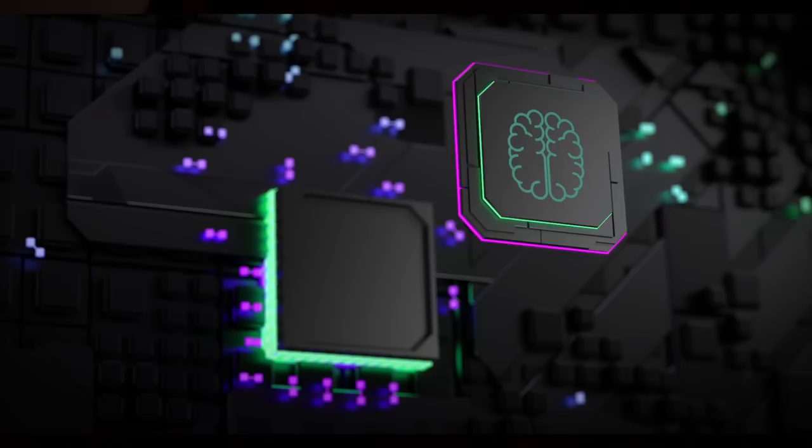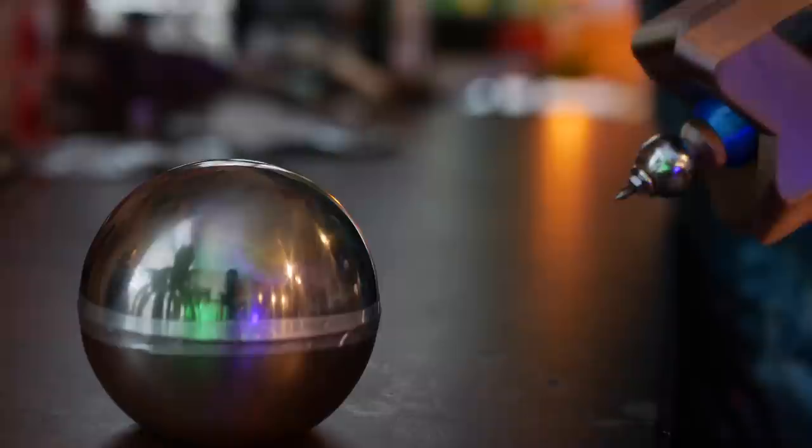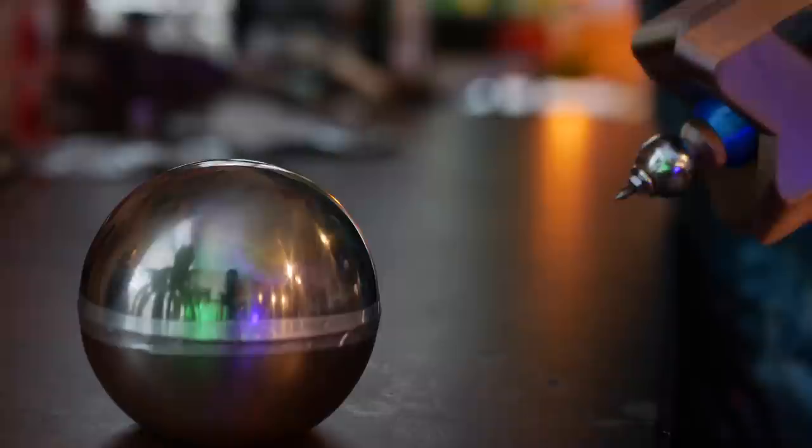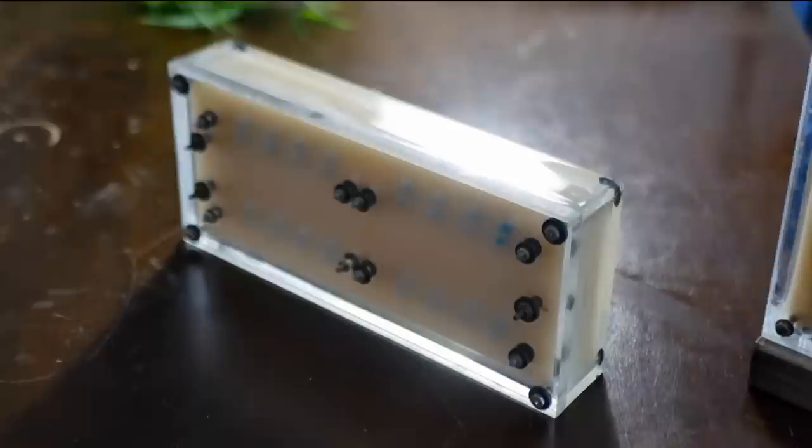In place of a projectile, static ray guns use high voltage to ionize air molecules and then shoot them a good distance. To accomplish this, they rely on a very smart circuit. The circuit consists of a 12-volt battery powering a high voltage transformer that provides 8–10,000 volts AC. This is then fed into a voltage multiplier, which converts the high voltage AC into even higher voltage DC at a lower current. Your body is connected to electrical ground, and since the extreme voltage is directed to a point, it ionizes the surrounding air molecules, repelling them away to go wreak havoc.